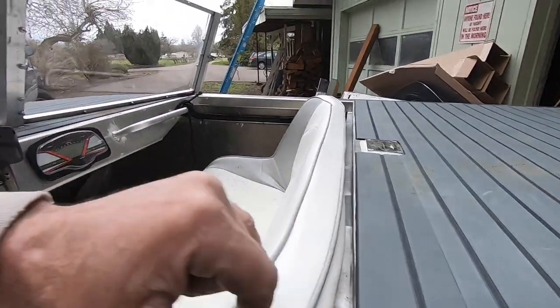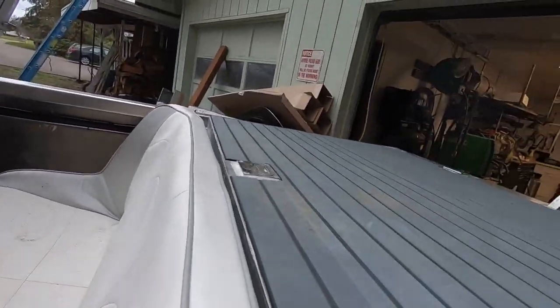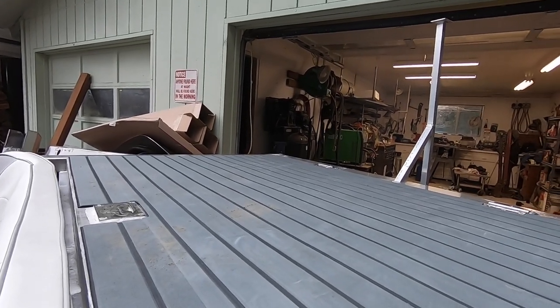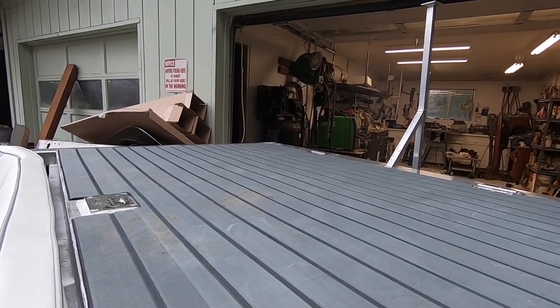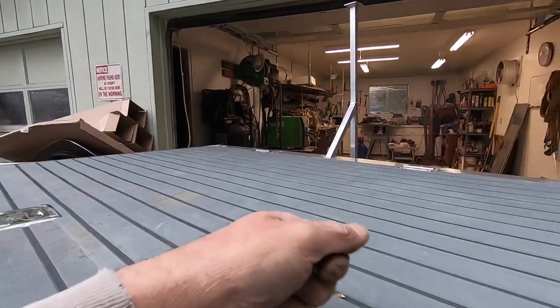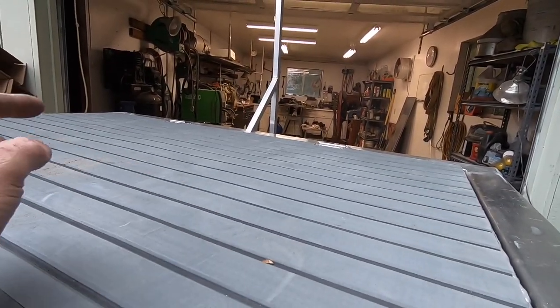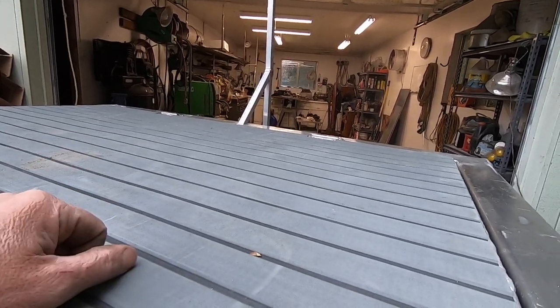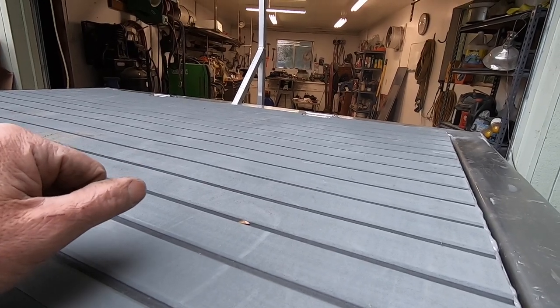But the fuel gauge is a little bit weird. I put fuel in the tank, about 8 gallons. I started out with 2 or 3 from a can I had here, and put about 8 gallons in. I was banging on the other tank. And I think it's airlocked on the crossover tube because it goes down and has a trap underneath the pump shaft. So I need to pull the other end off and bleed the air out.